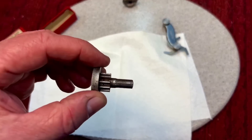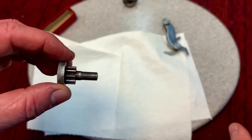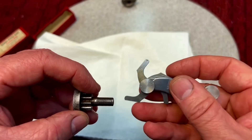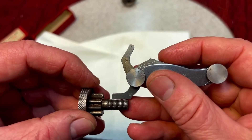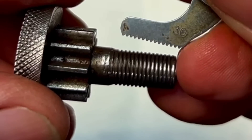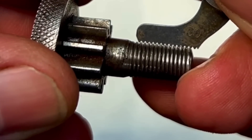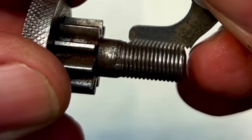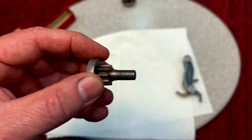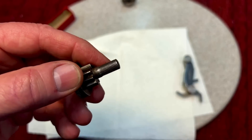The first thing we want to do is determine the screw pitch and thread. A lot of times with these tools, they had their own threads — before they standardized threads, they used to make whatever they felt like. This one here is 5/16ths thickness. By using my thread gauge, you can see 32 doesn't fit. With a white background, here we have 30 — this is 30 threads per inch. I can get it to match on the top half, so this is 30 threads per inch by 5/16ths. We don't even have a die or a tap for that, so you have to go to a size lower, shave this down, re-thread it, and then make a new nut.